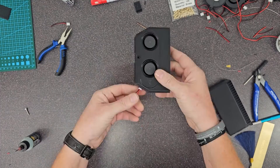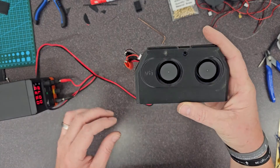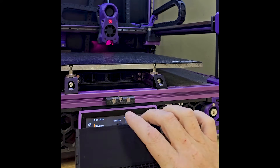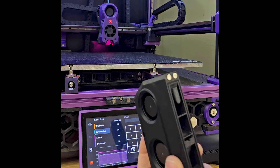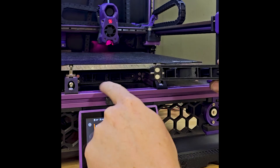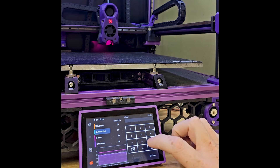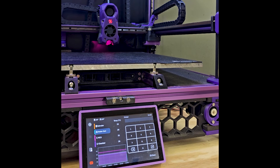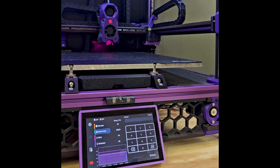I cut a little wire to do a bench test to verify this thing works before putting it on the machine. Hook it up and she spins! I've already got this thing full of carbon. You need an M3x16 screw for this — it screws right into that channel there. On the machine, if I turn my bed heater lower than the current temperature, the fan kicks on and we are working. I have mine set so that when the bed heater is on, it activates the fan. Right now it shows 28 degrees — turn it lower and it automatically activates, blowing out the top.